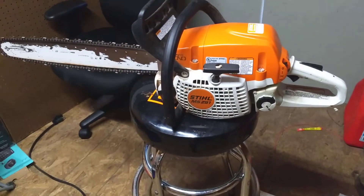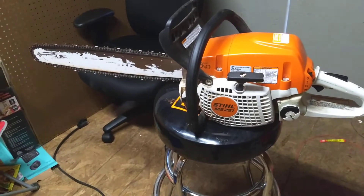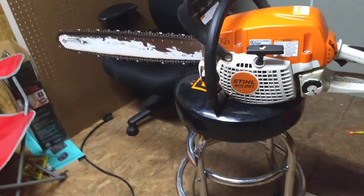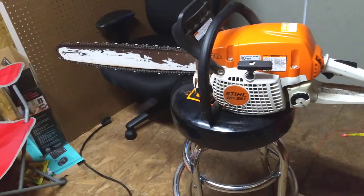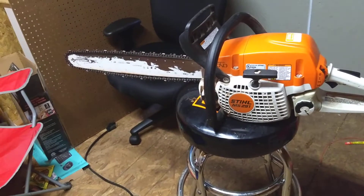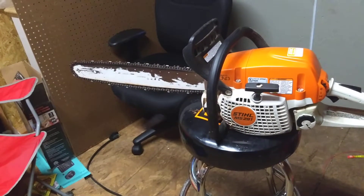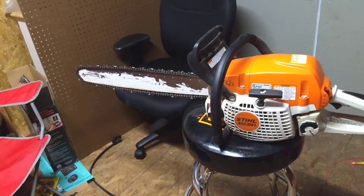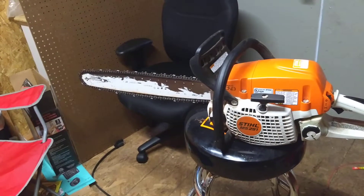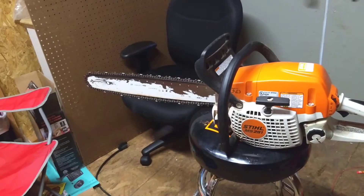It's pretty much for cutting firewood — it's not a logging chainsaw, but it does a really good job. It'll run through a 16-inch diameter red fir log in about 15 to 20 seconds without holding too much pressure, and makes nice big chips. One thing I learned: when your blade starts producing dust instead of chips, it's time to sharpen it. You want nice big flakes coming off — that shows you're taking good bites and your chain is sharp.